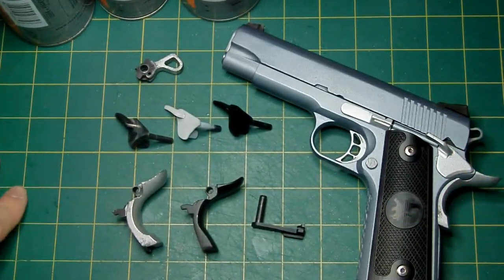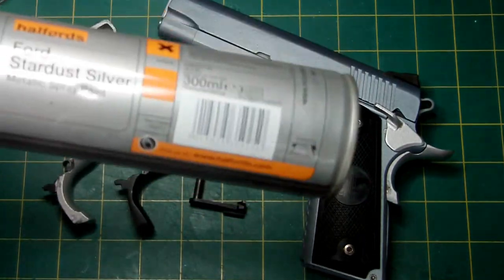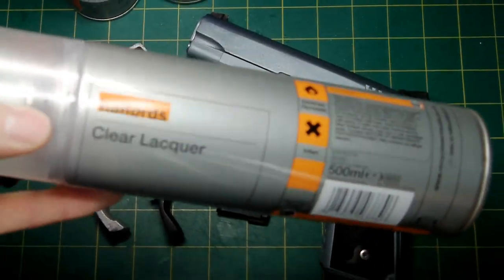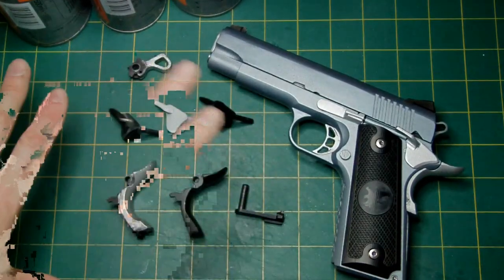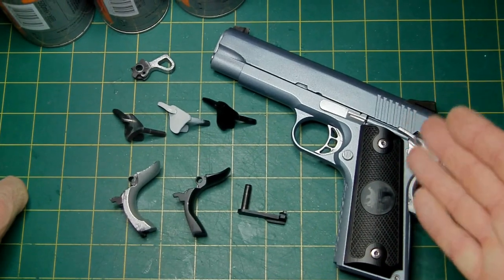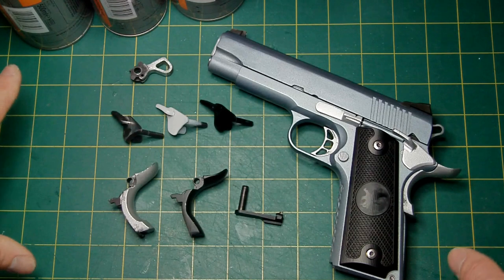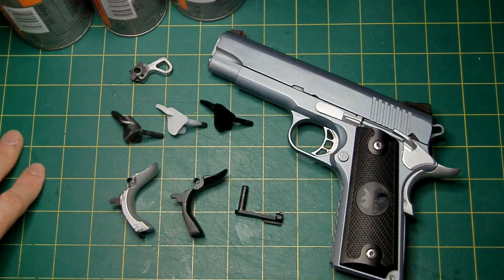So that's the major stages for painting metal parts. You'll need a decent primer, then your top coat — silver, black, blue, pink, whatever colour you want — and then a clear lacquer coat to seal it in and give it a tougher coating for general wear and tear. Overall it will chip — there's no way around it because these are parts touched most by you, they brush against holsters, and so forth. In a year or so when it's looking tatty, you'll just strip it down again and repaint it. If it's going to be a display model or used only occasionally then it's a great process. It doesn't take long to respray it again — just strip the part out, sand it down, and away you go.